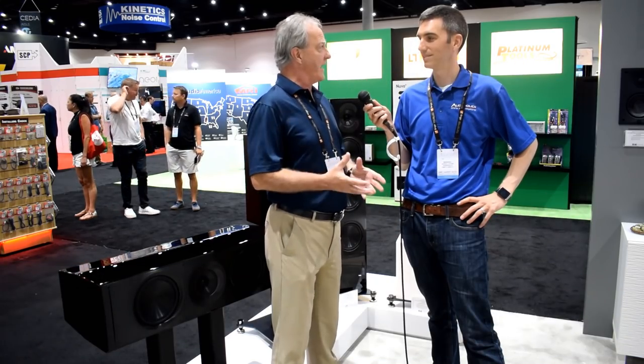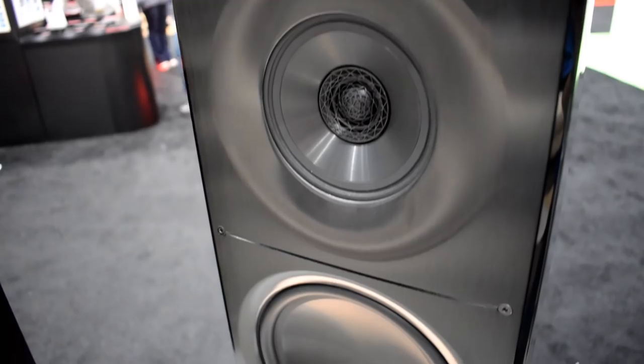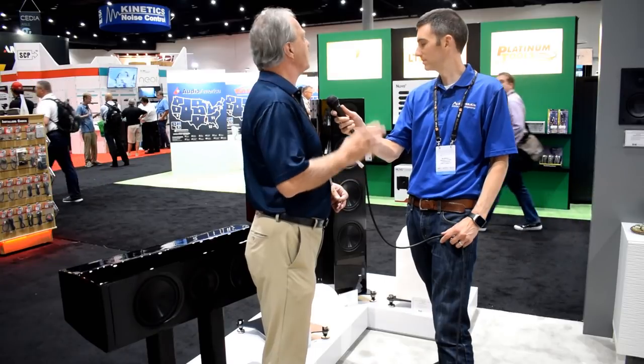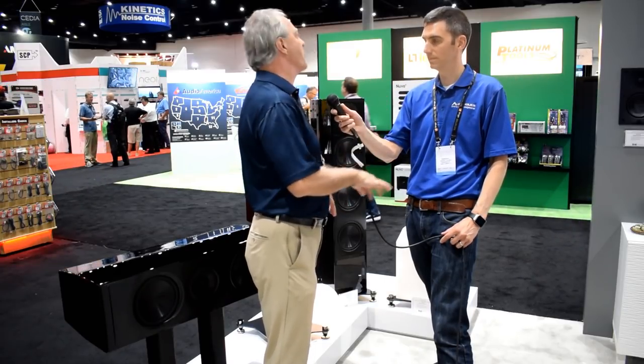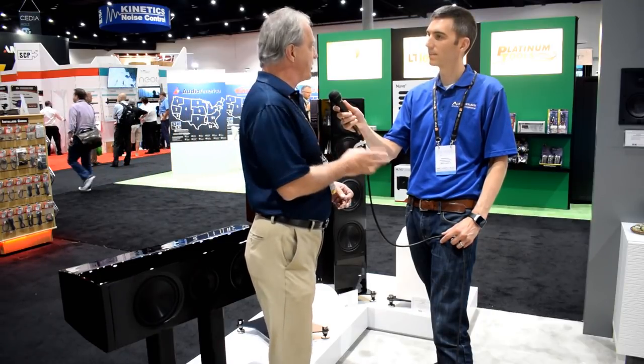It's the newest speaker series that we're doing, and it's a significant step up in price point from what we did have, but that's deliberate because so far I've been doing the very affordable speakers, but as a company we're used to doing more unaffordable speakers, so I've got to take care of everything. We start with the familiar, which is a concentric driver. The upgrade from what I did with UniFi is this is now a 5-inch cone rather than a 4-inch cone, still aluminum, but a new cone profile, newly developed for this, combined with a 2-inch voice coil rather than a 1.5-inch.